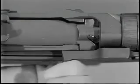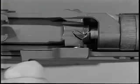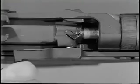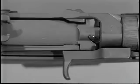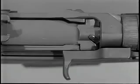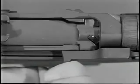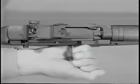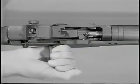The corresponding radii of the locking lugs on the bolt and the locking recesses of the receiver, along with the rotation of the bolt, allow a slight rearward movement of the bolt. This rearward twisting action loosens the case in the chamber and causes slow initial extraction. When the bolt continues to the rear, following unlocking and extraction, the spent cartridge is ejected.